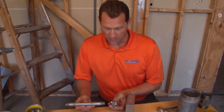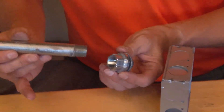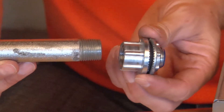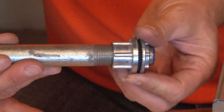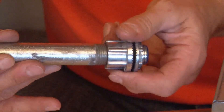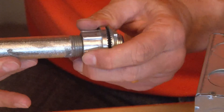The way that these watertight hubs are installed is quite simple. There is a threaded aperture on the watertight fitting that matches the threads on the rigid conduit. Simply align the front of the fitting with the threads on the rigid conduit and tighten until it's securely on the conduit. Using a pair of pliers or channel locks, you can grab the flats and tighten it very securely.